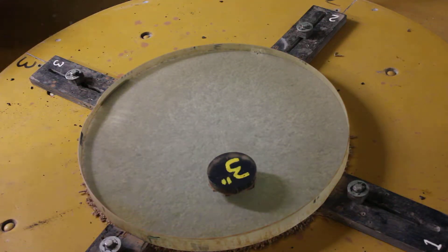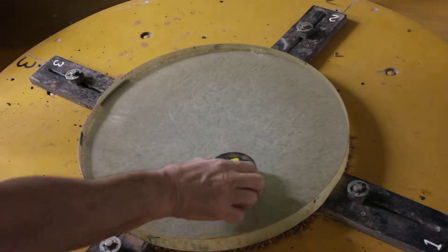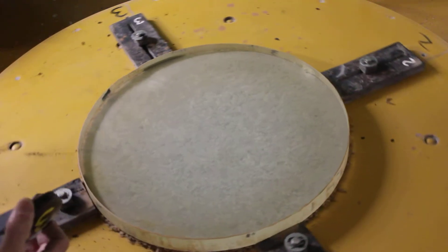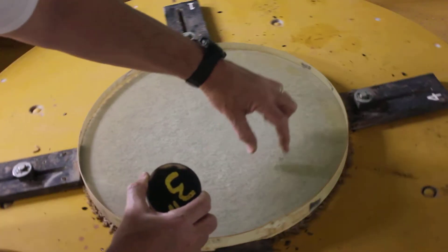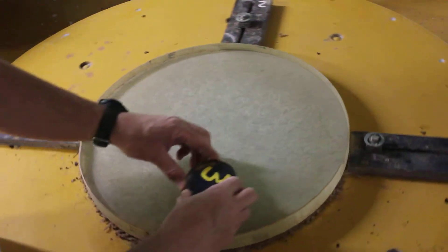This is for correcting a zone, and I'm not actually going to be polishing this — it's a 3-inch lap on an 18-inch mirror. I don't have anything on here to work with, so I'm just going to suspend it, but you can see the strokes I do. If I wanted to correct this zone here, I could do straight strokes just like this.